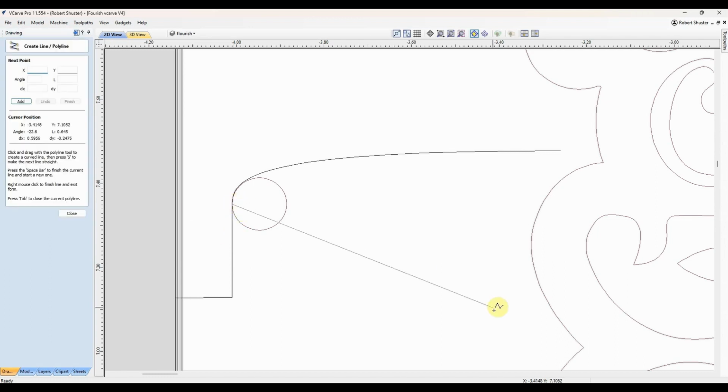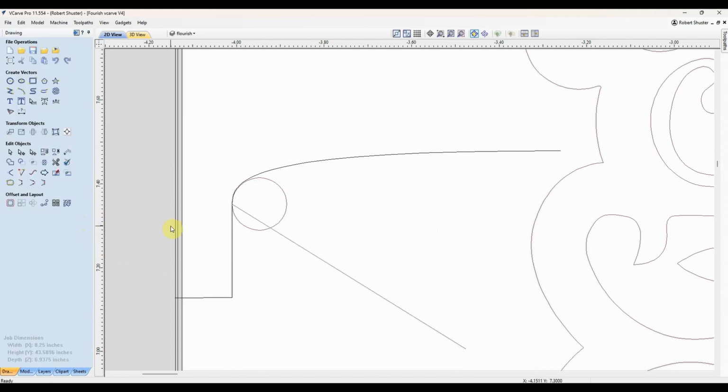At this point, the drum will cut away. So this will be wood here. This will be the open inside of the drum, and the drum head will hit right here and then contour down. So I do what I call a contour radius. It starts at that 1/16 and then gradually flattens out till it's level here. So not just a basic one little circle here. It conforms better to the drum head, I believe.